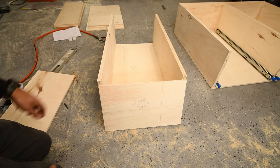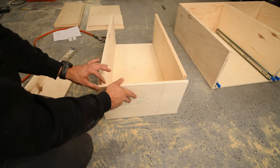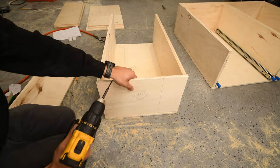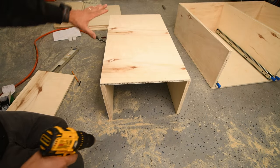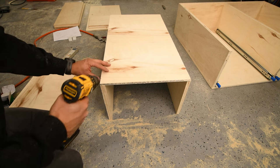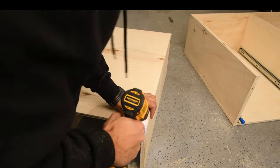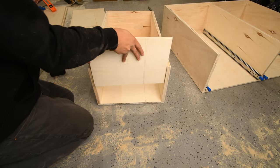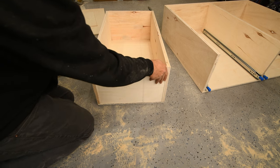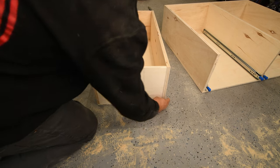Now we're going to assemble our drawers. We have our drawer sides and our back. Put some pilot holes in the sides — I'm just resting it on the drawer bottom and will screw into it, but first attach the back to the sides. Once the backing is on, flip the drawer upside down and screw the bottom into the sides with pilot holes. Now we'll put the drawer front on — this goes between the sides. I consider this the front of the drawer, but we'll also put a face plate across here which will have our handle.